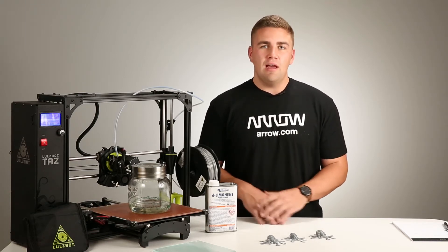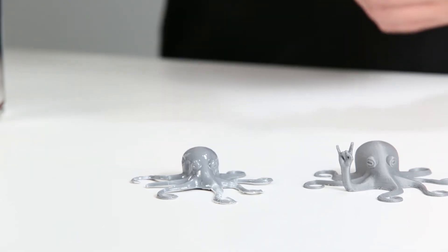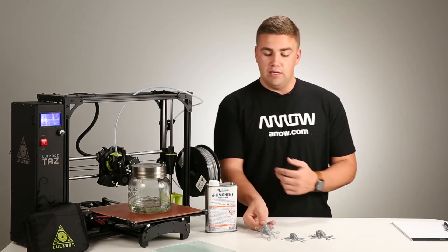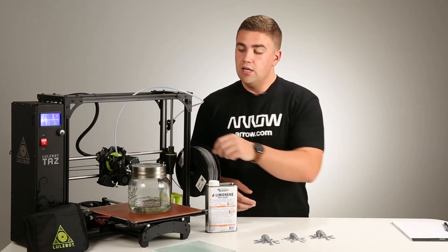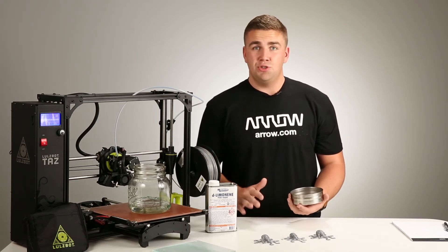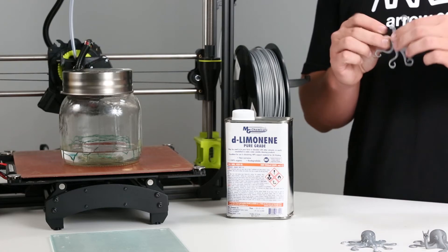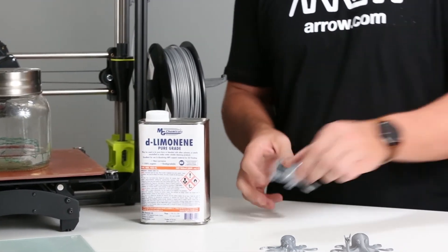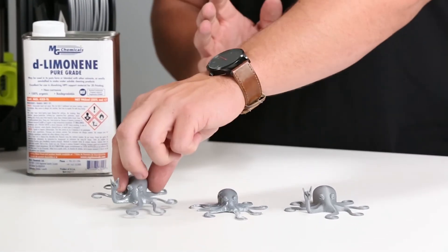All of the forums I've read never mention the fact that it's sticky. We actually ruined a couple of these because I went in to grab it with my fingers and got fingerprints on the side because it's super tacky. What I'd suggest is to have a well-ventilated setup with some sort of air-pulling system so you can take off the lid, pull all the vapor away, turn off the bed, and just leave it for literally two or three hours. That lets the air cure all of that vaporized and essentially melted material, and then it ends up being really smooth to the touch. If you don't do that, you'll end up getting really fine surface defects.